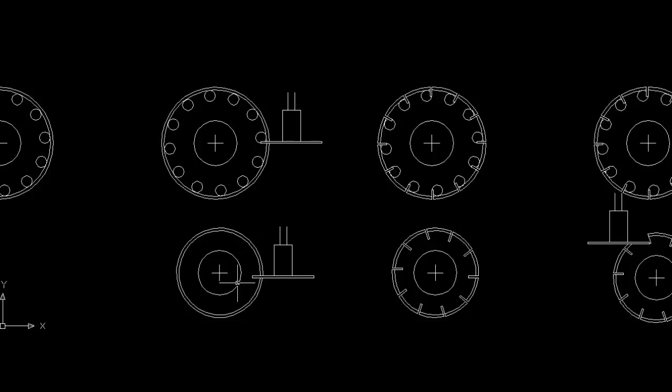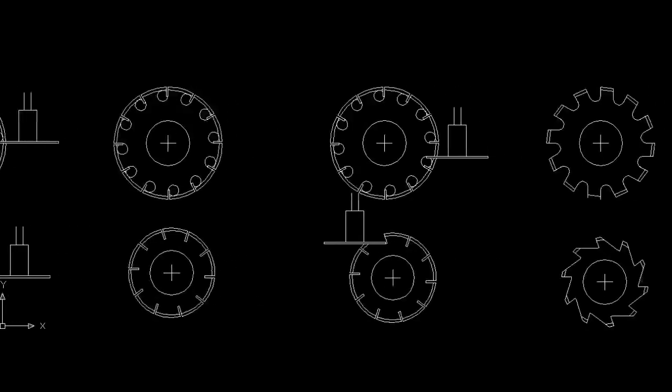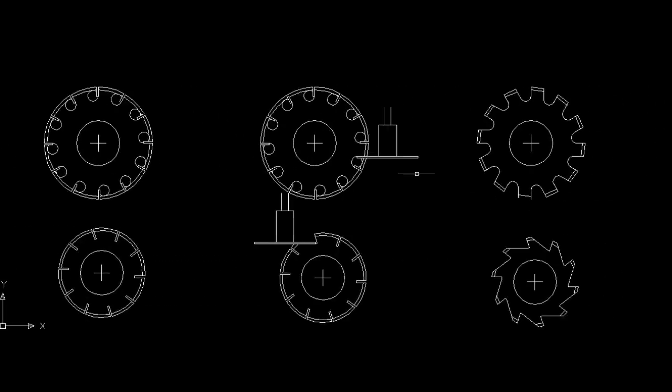I may do something like this with the Eureka tool later after I've played with it for a bit. And then when your cuts are completed, this is what the blank on the Eureka tool looks like. And this one is the one for Porter's. And you can see that there is a scooping action that you get with that radial rake. The next move is a slitting saw for both of them.